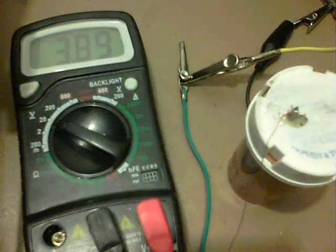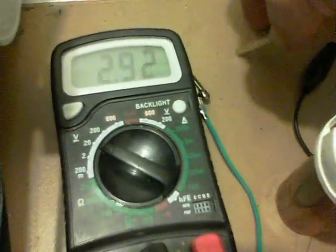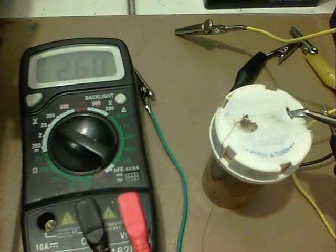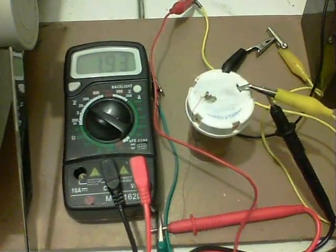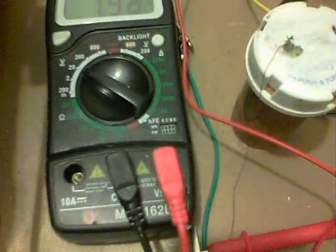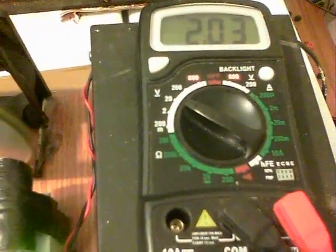If I disconnect, this collapses quickly. I'm most likely going to put copper in there anyway, looking at how this one's going — which is great. So this is with the fresh alum mixture. Half an hour later now, this graphite and galvanised steel first cell is now settling out at about 1.9 volts. The other one, which is burnt copper and galvanised steel, is charging at 2.03 volts.